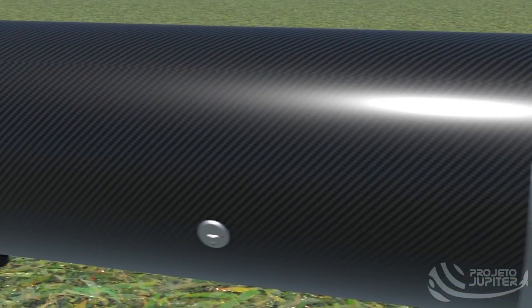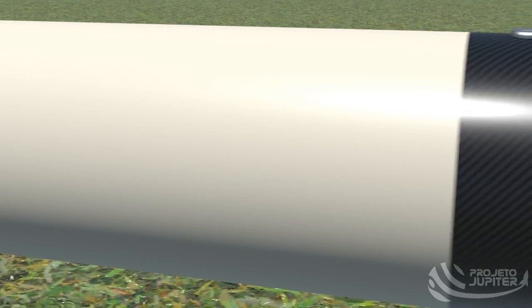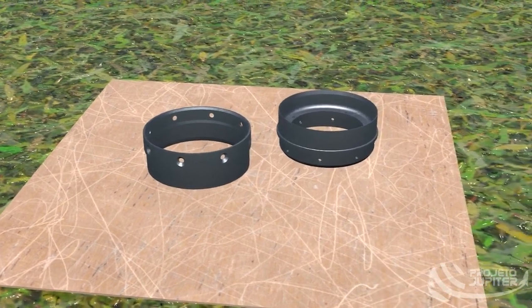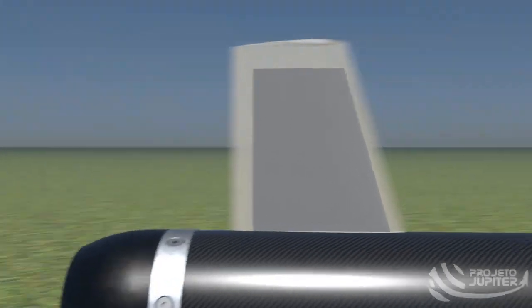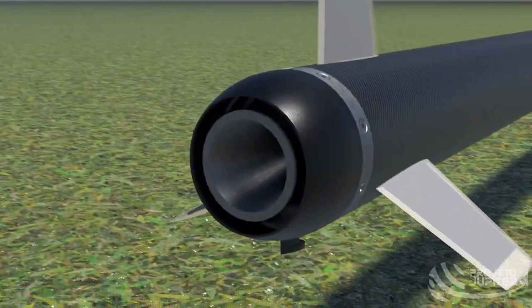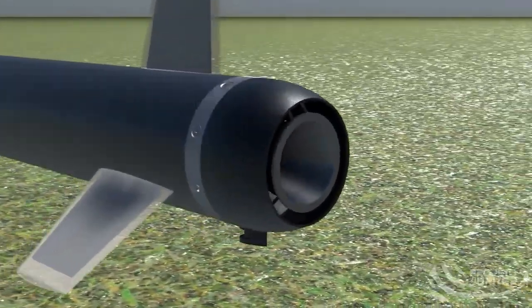The external region was painted using a polyurethane-based paint, aiming at greater resistance to weathering and increasing hardness and flexibility. The design of the aluminum connections aimed at easy assembly and disassembly, considering there are detachable fittings, without losing capability in the main function of resisting the efforts applied during flight. The fins remain as carbon fiber with a trapezoidal shape, with the use of an airfoil for aerodynamic contribution. Finally, after a study to optimize the shape of the tail, the resulting design corresponds to a spherical section, made through a mold and manufactured by the members.